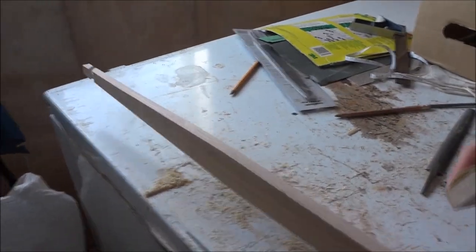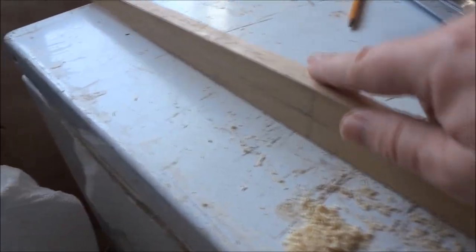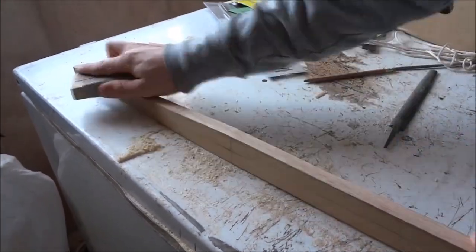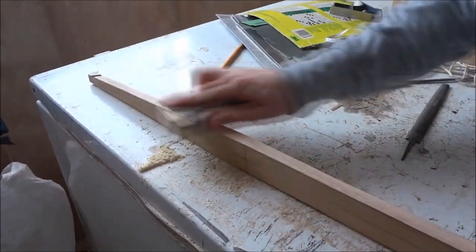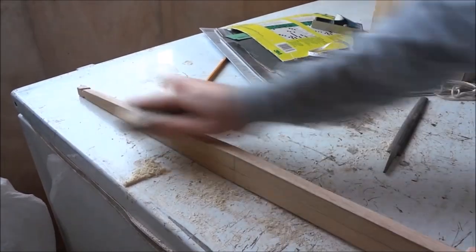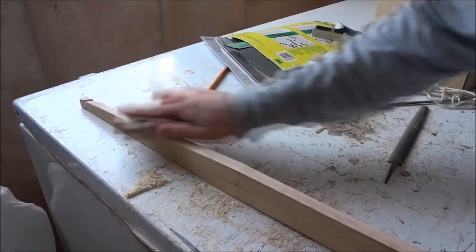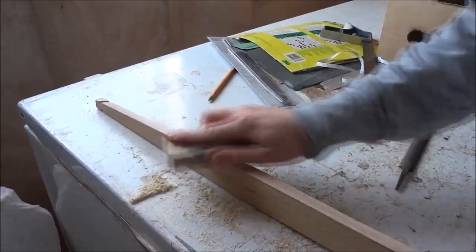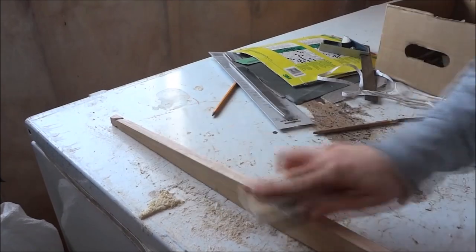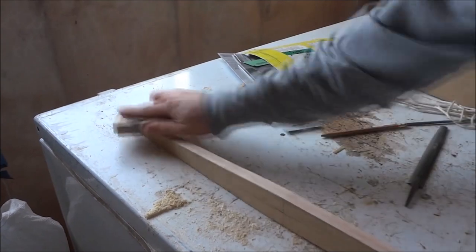Let's look at the other side and see how rough it is — it's quite rough right here. You want to put your eye toward the sun and eyeball down your bow. The tiniest little defect will show up. When you start with 50-grit and go to 100, you'll see what the 50 did; go to 240 and you'll see what the 100 did. Leave yourself a little extra wood at the start — if you want one and a half inches wide, go one and seven-eighths and work down to one and a half.